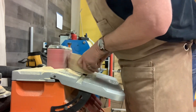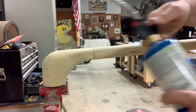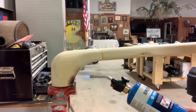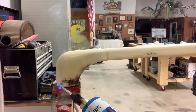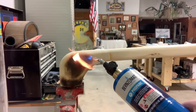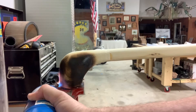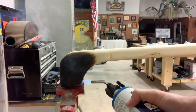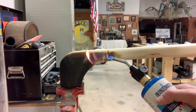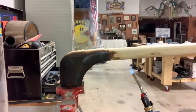I'm going to add some lines on this. I'm not going to go as far as doing the traditional cross-check pattern — you'll see at the end what it looks like. So here I am burning the wood. You can get a better look at this in my previous video on the rifle gaffy stick where I go through all the steps. Basically to recap: I burn it with a torch and then with a metal brush on my drill I remove all of the burnt cellulose, and it leaves behind an amazing weathering pattern. It's just so cool.